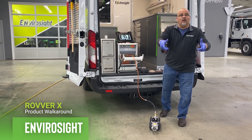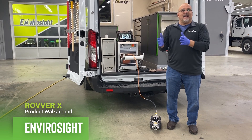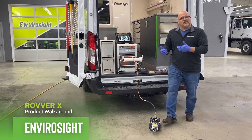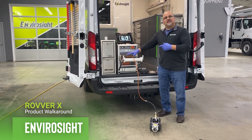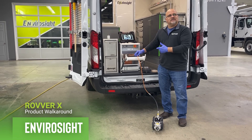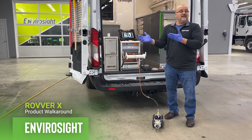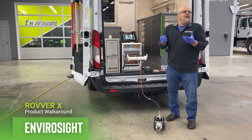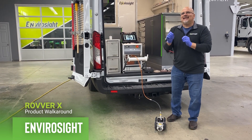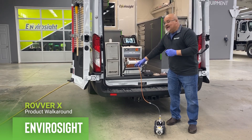The automatic cable wheel feeds it forward, and on return we don't drag. Nothing that I know of professes reliability while also having drag. If you're dragging something, it's usually not very reliable, so we chose to drive back. You also notice the color of the cable is orange. On retrieval, as we're coming back, we want to be able to see the cable in the sewer water — a brown or black is not a good color choice. To profess reliability, we're taking every little nuance we possibly can, hence the color.